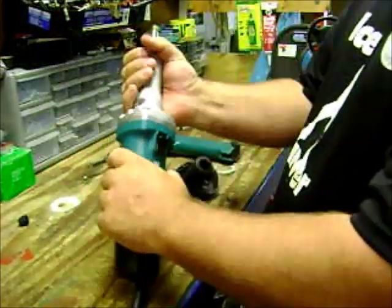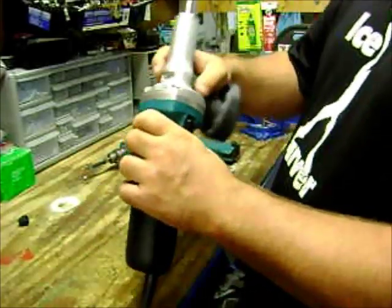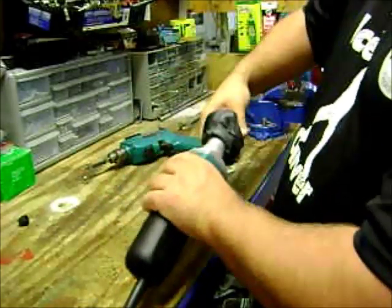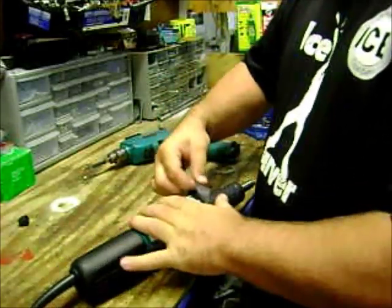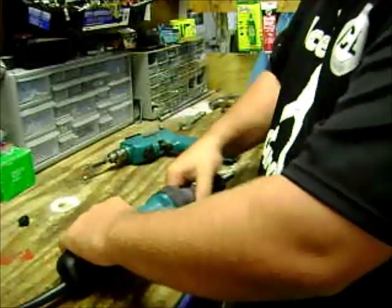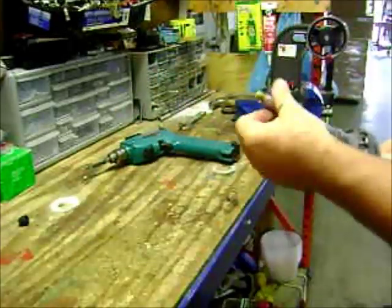Once you put the 4 screws in, the neck's on securely, then you'll see there's these 2 rectangular shapes here. They fit into these 2 rectangular shaped recesses, so start it off so that they're lined up towards each other. Slide it down, and then work the skirt or the flange part of this rubber over here. Make sure that those pieces are properly seated in there, and you're all set. You can install the shaft.